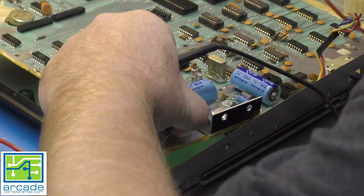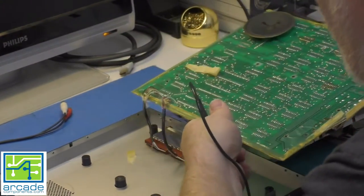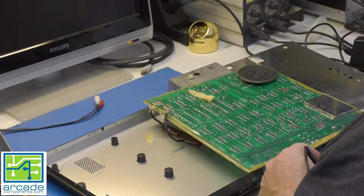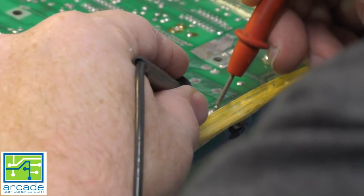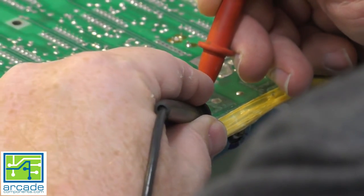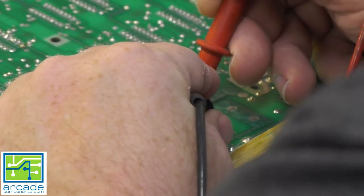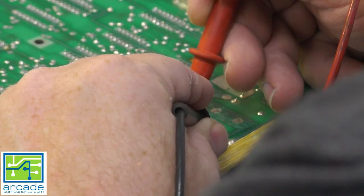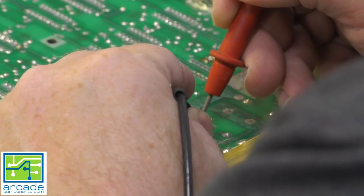Let me lift the board out - I want to check the bridge rectifiers. To check a bridge rectifier, you check it just like any other diode. It has four posts: AC input and DC output. We're going to put the meter on regular ohms and go backwards and forwards between pins 1 and 2, 2 and 3, 3 and 4, and 1 and 4. If you have a broken bridge rectifier, they typically short, and when they short you start blowing fuses or overloading the transformer. When you have a leaky one, they won't always blow the fuse - you'll start blowing capacitors or your voltage regulators will go crazy.